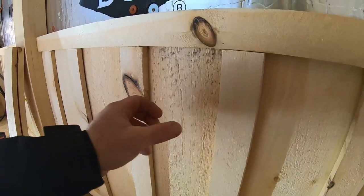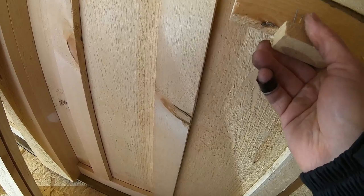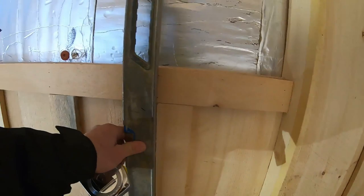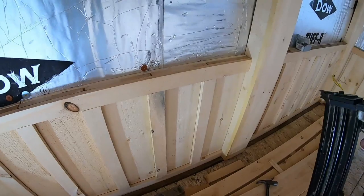I'm gonna take a blade off because I got these little jigs I made that are seven inches. This lets you know where to be when you go to nail. Start on your end, and like I said, don't nail any of these one at a time. First, get your measuring off your beam right here, plumb it up, make sure it's plumb. Once it's plumb, then you can nail that.